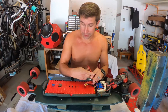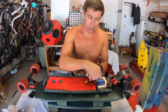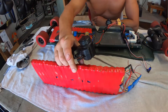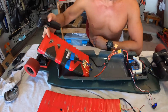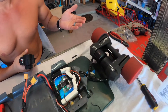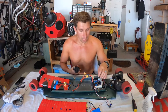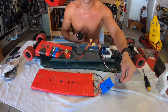This warrants further investigation. I'm going to expose the BMS and the battery, check all the cells, and see which cells are functioning. I know for sure there's a problem because I put in my tester pack, hooked it up to the speed controller — that eliminates the speed controller from the problem equation. Next up: testing all the individual cells.